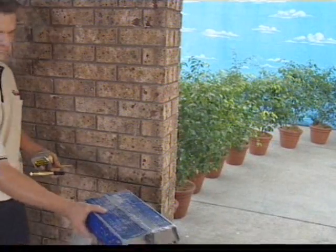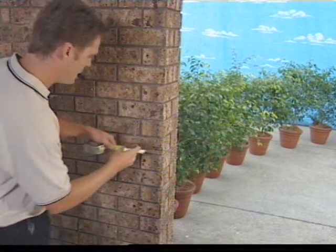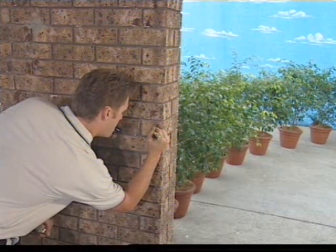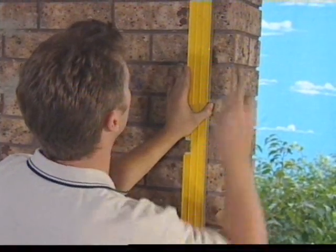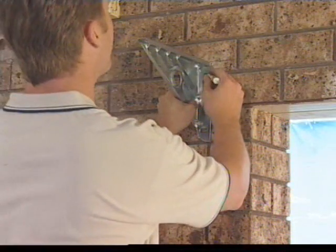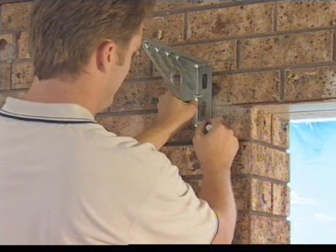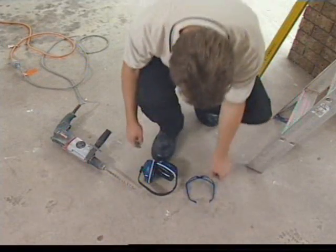Measure the door and opening widths to determine the amount of door overlap to enable correct positioning of the brackets. Add a clearance of 10 to 75 mils from the edge of the curtain to the inside edge of the brackets to determine positioning of the bracket. Mark two hole positions using top and bottom slots of the bracket. Drill both holes, ensuring that you use appropriate safety wear.